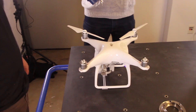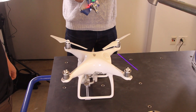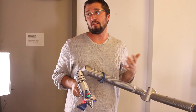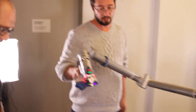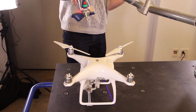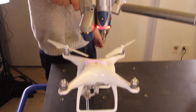Scan as fast as possible — this thing can record 200,000 points per second if you let it. We're scanning directly to a point cloud, not to a mesh. It allows for higher performance using all those points, and then you worry about the mesh after — that's the later processing step.